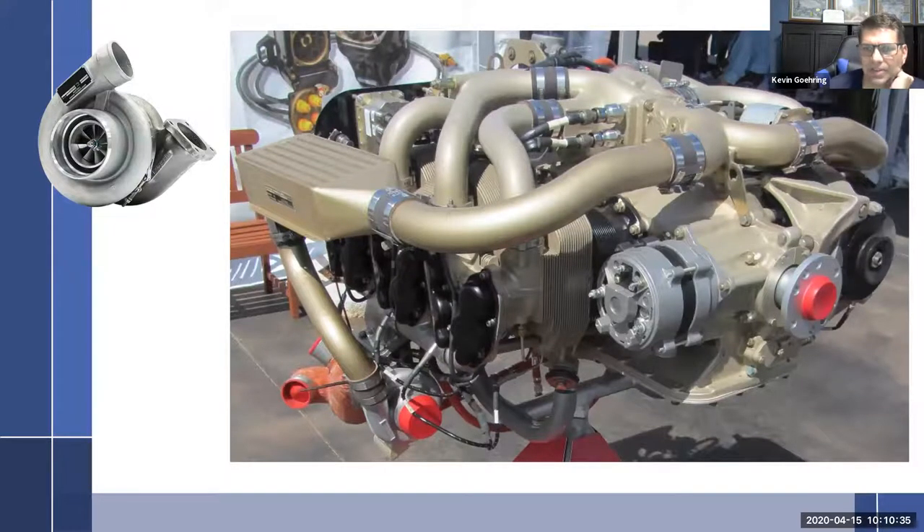This is very typical of all these systems. Look at these hoses — one, two, three, four, five, six, seven — that's fourteen hoses, and that's actually a light load. Every one of these hoses is held on with hose clamps. It's holding this entire pipe in place; you sit it in place, slide a hose over, and clamp it to each piece. It's really common for mechanics to not get these rubber couplings on all the way, then clamp it down, and as soon as pressurization starts it blows one off. At an IA seminar, an NTSB guy spoke about an accident he investigated where exactly this happened — they didn't slide the rubber coupling over and clamp it properly, and once a pressure differential built up it blew the coupling right off.